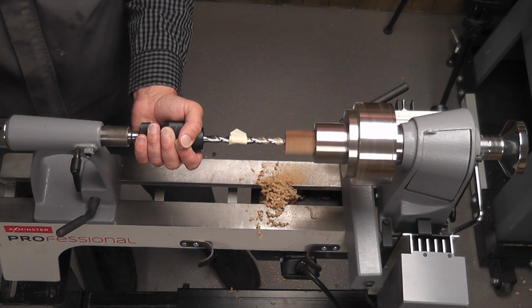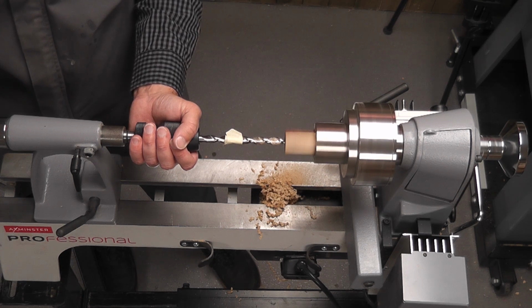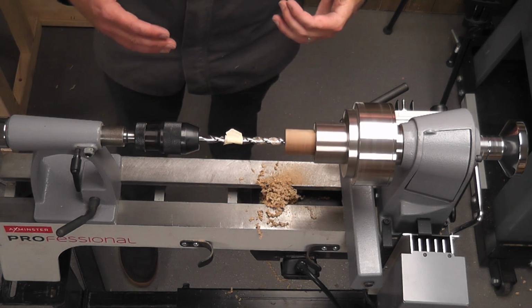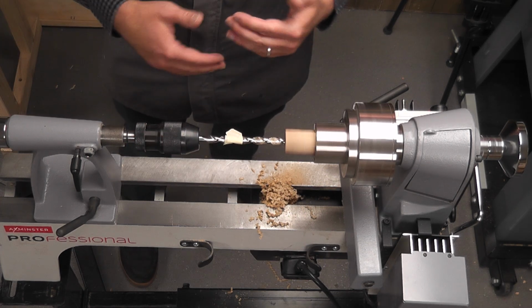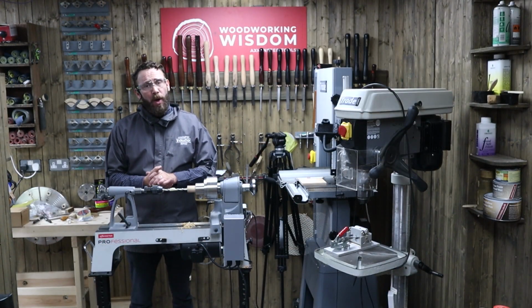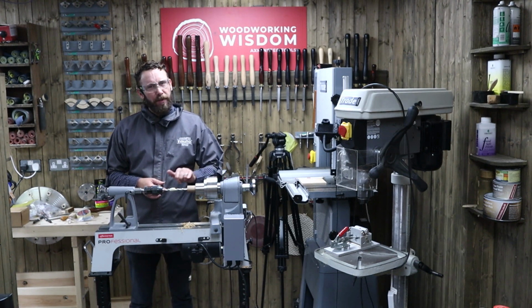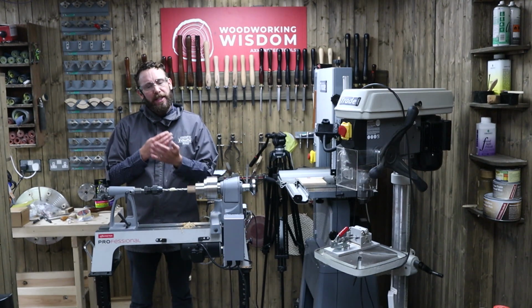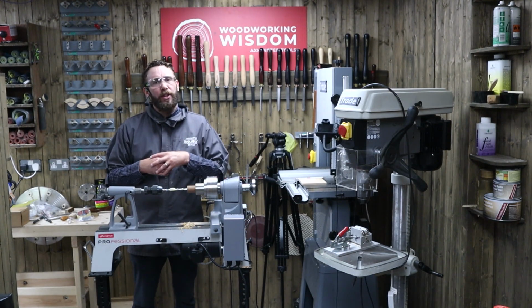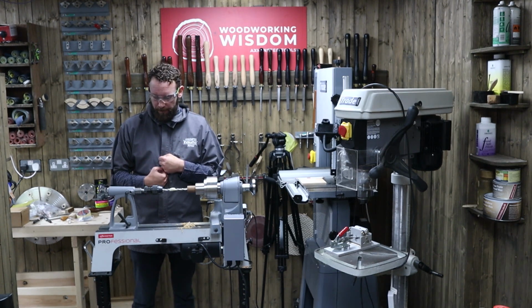Just coming out of the cut there, and it might screech a little. You know, they've got the friction of the blank just moving across those little cutters on the drill bit. What you don't want to do, like in long hole boring, is put any kind of oil or wax on that, because that's going to create an interface, and the glue won't then grab onto the timber in a bit.